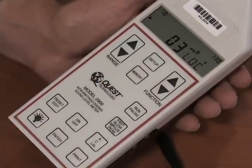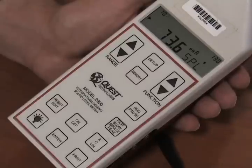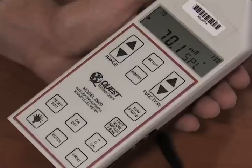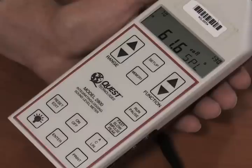To data log, push the run-pause button. An arrow appears in the top left-hand corner of the screen and the timer starts. When your survey is complete, pause the unit by pushing the run-pause button. The arrow changes to a double bar and you have created a study within a session. You can now download the data.